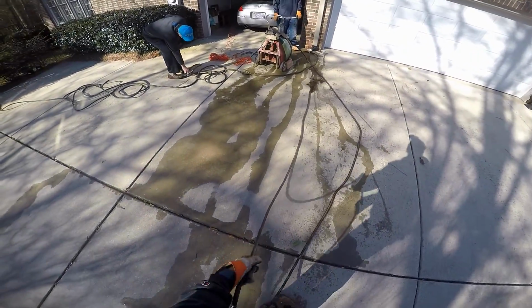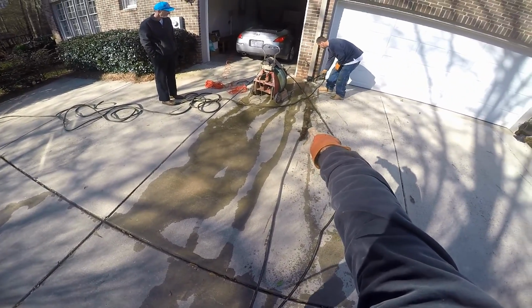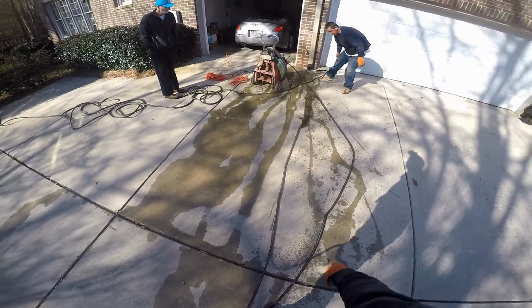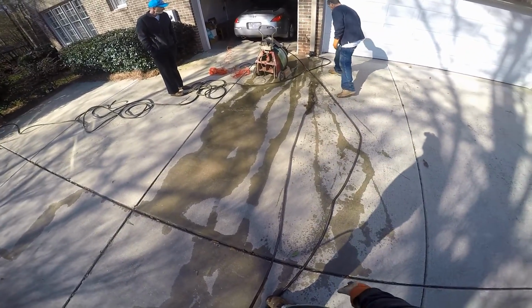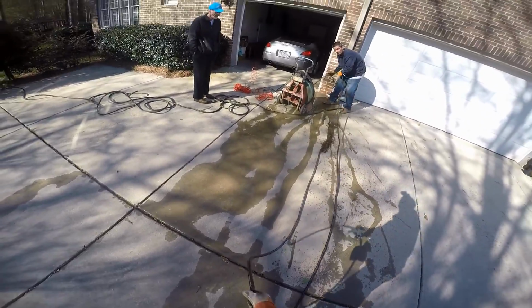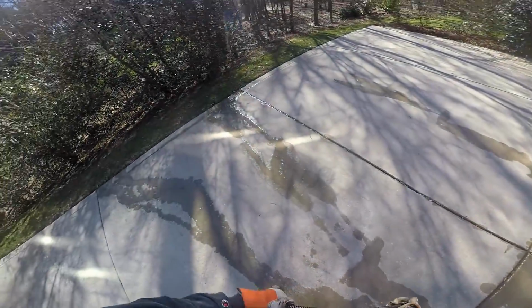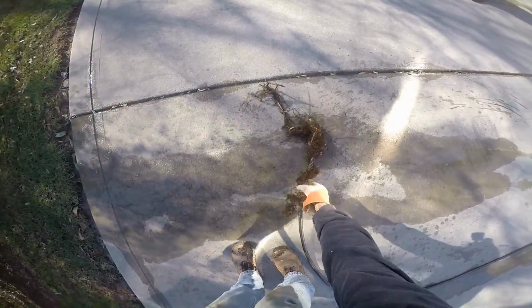There are a lot of comments, and in those comments there's questions. And the biggest question that we get is, what type of pipe should we run under the driveway? And of course my answer is run PVC. You can run SDR 35 or you can run Schedule 40 PVC, and that's because we don't want it to crush. But people don't think about, what about tree roots?